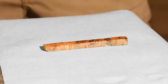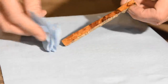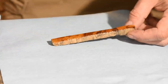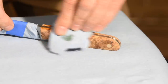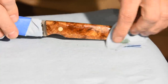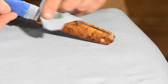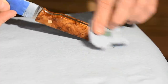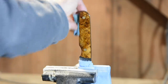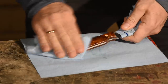Next I'll finish the wood. I always like to test my finish on a piece of scrap wood before applying it to the knife. Some finishes look muddy, blotchy, or overly dark on particular types of wood, and you just really never know until you see it. Here I'm using tung oil, so I'm just applying it with a shop towel. After a bunch of applications, I'll buff it out.